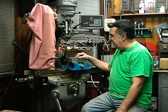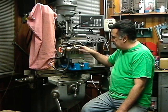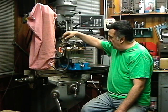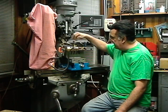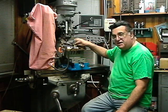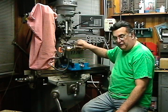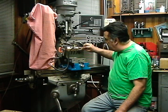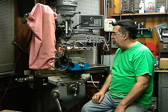The small valve here — this is the pressure side, so there's pressure against the valve. By movement of this it opens the valve, and then as this moves it shuts the valve off. If you stop moving, it acts as a pivot and shuts itself back off, then recenters itself. Even if there's any movement in this it's going to continually reset itself. That's one reason why you always want to keep pressure on this — some people turn it off and that's not a good move, because as the valve gear pushes against it, it continually recenters itself.